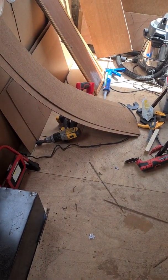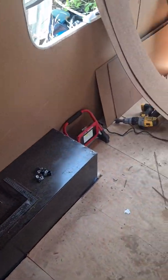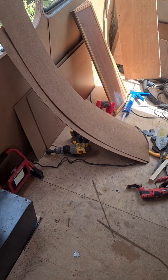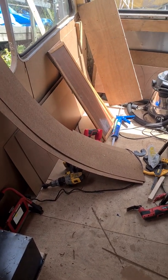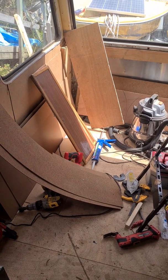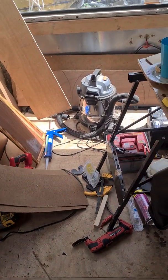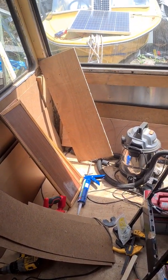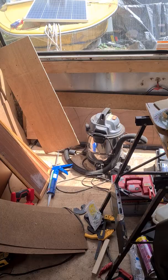So I found a joint in it and I just separated that, and I'll drill a hole and put it back through and chuck an MC4 waterproof connection over that, IP68 or 69 ingress protection rating, I think they are. They're actually solar power ones, but I've figured out you can chuck a thin gauge 5 core through it and waterproof a connection as long as you insulate each wire. They're easy to put back together. You just twist them up, jam them in, snap together, and waterproof. Other than that, that's it for the moment.